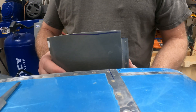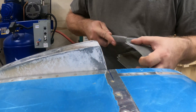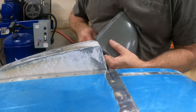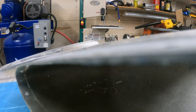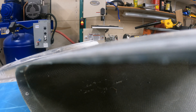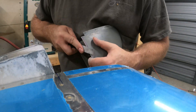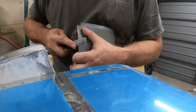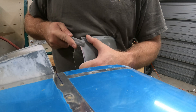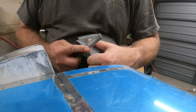There you can see the line of the curve that's actually on the elevator. I drew the line based on having the elevator come up against the fairing tip and just drew the line. Now I'm just filing down to that line. That gives me the curve — I know where the curve's at. Then you can see here, just taking a file, working it down, and then I'll put the fairing tip on and off checking for fit.